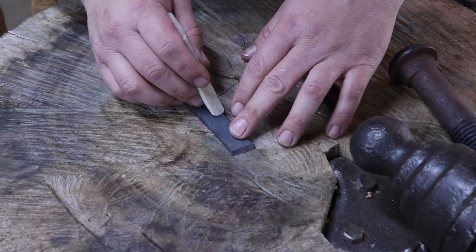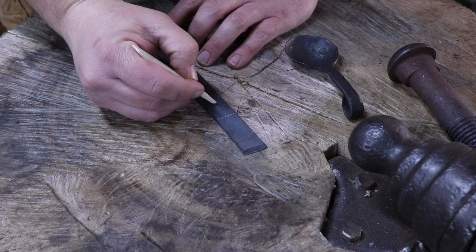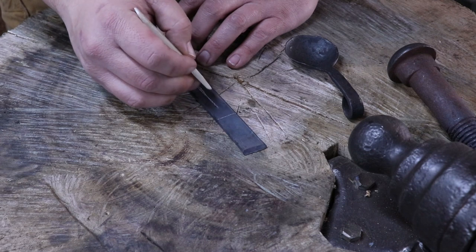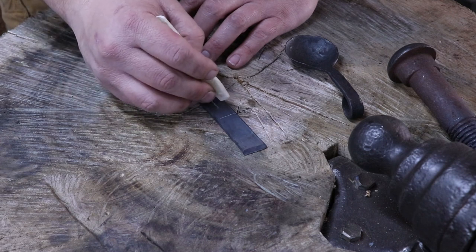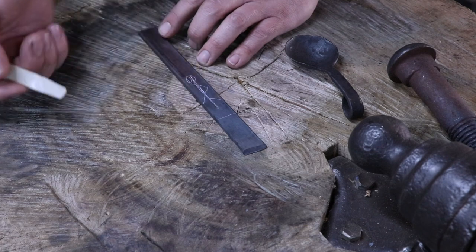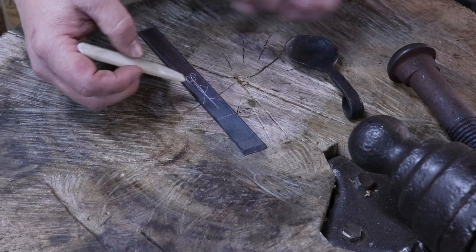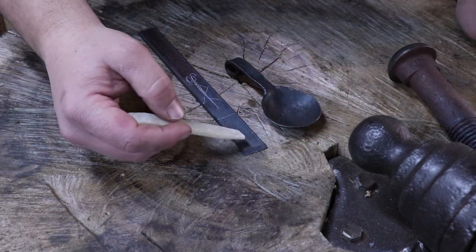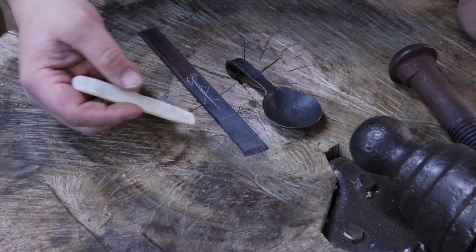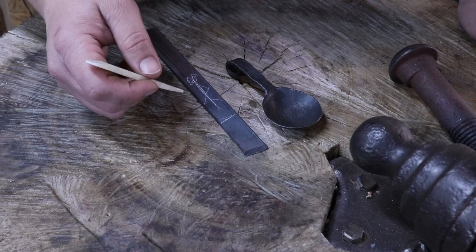I want to mark off somewhere around two inches, then I want to slot punch the bar backwards. Then I want to round all this off and run a twist so it'll just interlock as it's coming backwards. And put a small punch hole through here - nothing crazy. It doesn't have to have a very long handle. This one actually worked really well with that short little handle; it fits inside the coffee container very well. But we'll start from there and see how it works out.